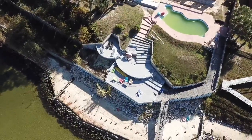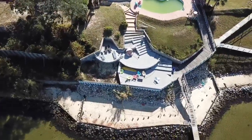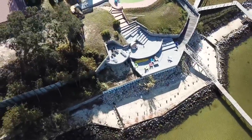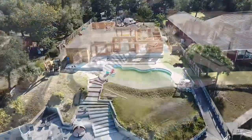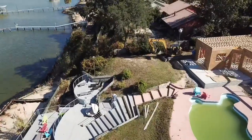We're going to be removing the circular decks, the stair systems, and the vinyl retainer walls. We're going to install a new vinyl seawall right behind the rectangular deck, leave that up about 8 foot. Then we're going to level the yard off and go back to a wooden retainer wall just off the edge of the pool to level the yard up and give them a flat surface.